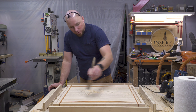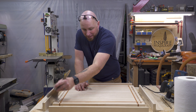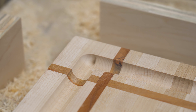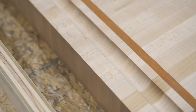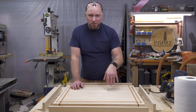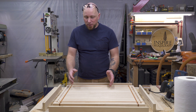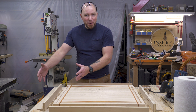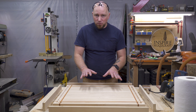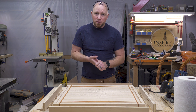I think this worked out just fine. I left myself a little bit of room for extra in case I wanted to go just a tad deeper, but I didn't get any burn marks — just a couple tiny ones in the corners that I'm not going to stress about, because as this board darkens you won't notice them anyway. You could use this exact same method for refinishing a cutting board that doesn't have a juice groove, or for one that does and you want to deepen that channel. Just line up your router bit, determine the width of your base from the center of the bit, set it up, and you're good to go. You can also stack pieces of plywood to make things more stable. Hopefully this helped somebody — that's all I've got for you today, thank you so much for watching.